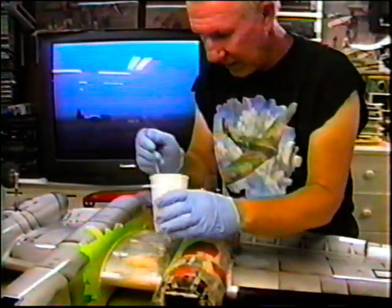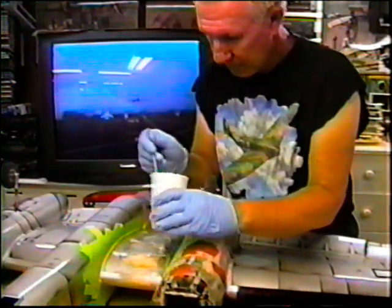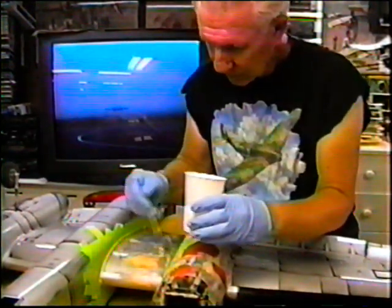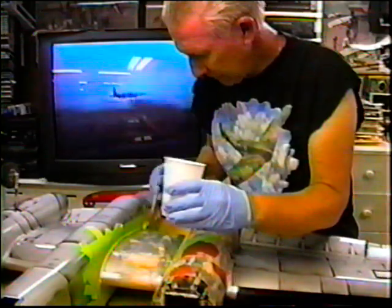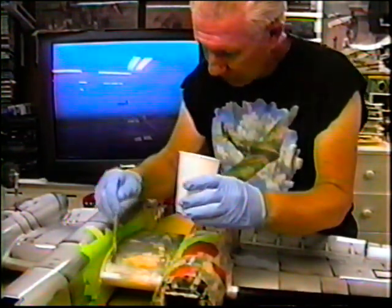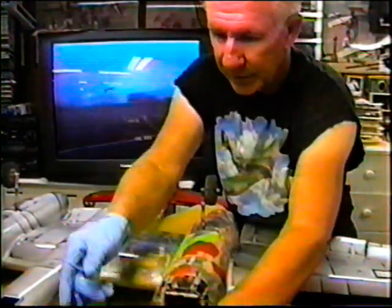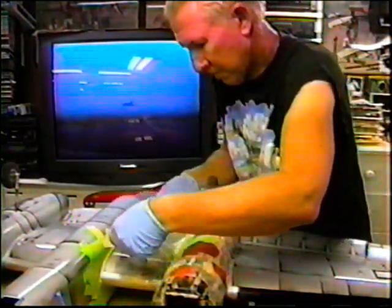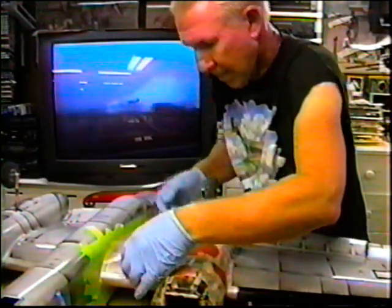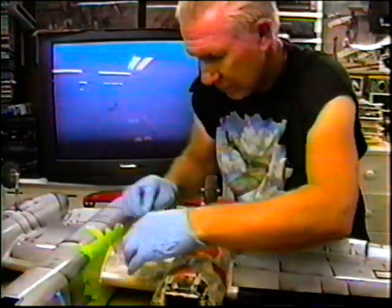What I want to do is see if I get any fish eyes. I've carefully cleaned this with M600. Looks clean. But if I were to see any fish eyes, I'd want to wipe this again, maybe even re-sand it. So far, so good. Again, remember, this is a structural joint. This is not a cosmetic thing. We're going to try to do this in one shot, flip it over, do the top.